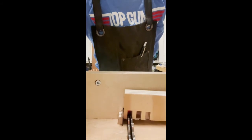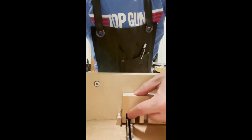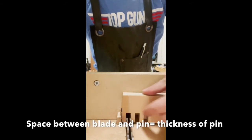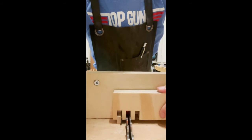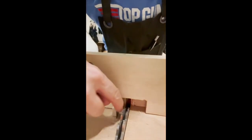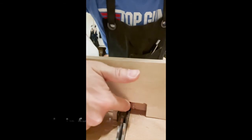So you're spacing — you're pushing against this area right here — and this determines the diameter of the cut here, but also the spacing between the pins themselves. Basically you're just putting the next pin next to this, and it's really the spacing that counts between the blade and whatever pin that you use. The thing that's different about this jig is that you can see there's a metal plate right here — I just used something from a door actually, and I just screwed it into the side.